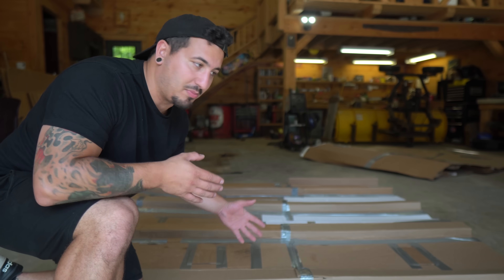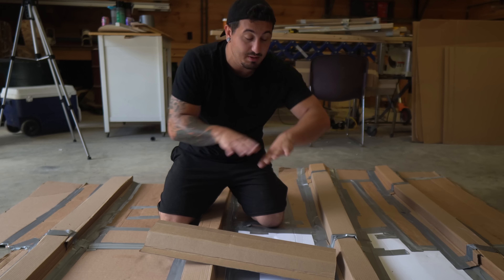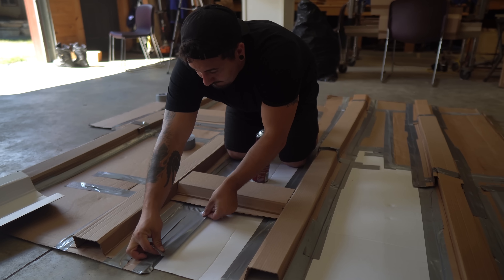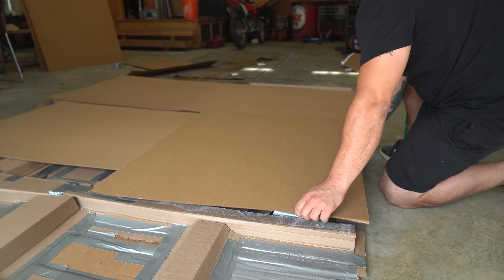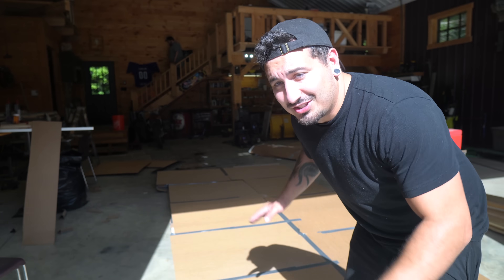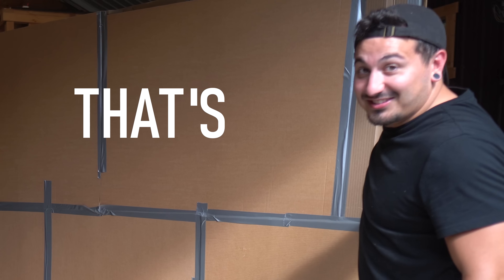But every time I picked these walls up, they bent over me — super flimsy, not gonna hold. I figured out a fix: take more support beams and lay them horizontally across between the vertical beams, giving me support in both directions. After putting all the horizontal support in the wall, it was time to glue down sheets for the interior walls. If I want Airbnb to take me seriously, I need these walls super thick and sturdy. Once the first wall was done, I stood it up — and it was super sturdy. Now that's a wall.